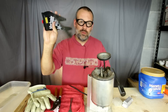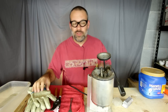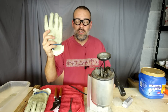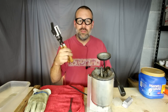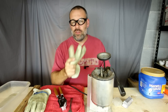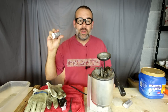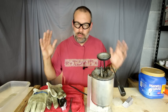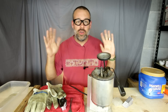You don't want that. Those Mechanics gloves are great for working on your car, great for tactical insertions, but not great for lead casting. Use leather gloves if you're going to wear them. Personally, I don't wear gloves because it really kills the dexterity of using these molds. But if you research this, solid non-organic lead will not absorb through your skin. So keep your hands out of your nose, eyes, ears, and mouth, and you are fine. Make sure you wash up afterwards.